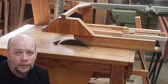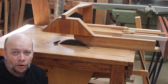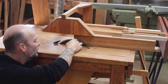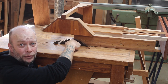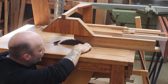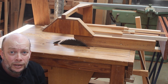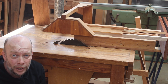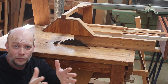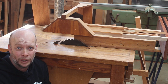Another critical thing to consider is the positioning of your fence. You can see on this machine here behind me — although it doesn't quite look right on camera — the fence here comes to about halfway through the blade, but it actually bevels back. So where the timber is touching the fence is somewhere around there. If you're ripping timber, you don't want your fence any further forward than about halfway along your blade, because your timber moves. You want to cut your timber to the size you want, but you don't want your fence to interfere with it.